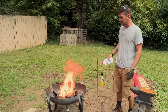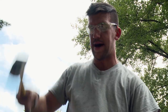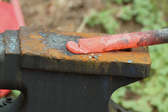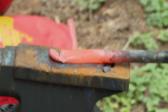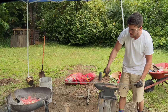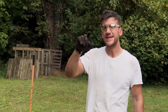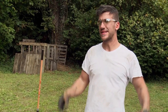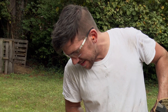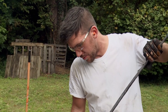Ready to forge and fire! Oh, got that a little too hot. I just left the steel in a little too long and it got so hot it started fracturing. I've got to be careful — never taking my eyes off that baby. Trying to get to two inches wide at the base of the blade and at the belly is not fun. It's getting extremely thin, which has me a little worried — an extremely thin blade is going to be prone to warp in the quench.